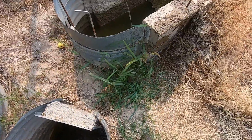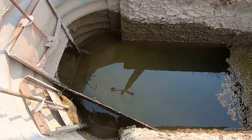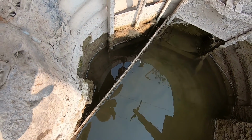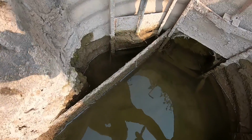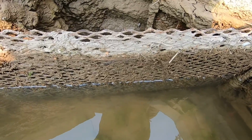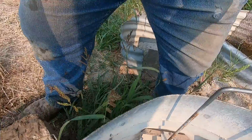It's kind of a puny little flow of water, and I can see why. The actual flow has been cut way down, coming down for some reason, I don't know why. I've opened up my gate here a little bit more, and got a little bit more flow coming, and I cleaned out that screen. I haven't cleaned that screen out for probably 2 weeks, 3 maybe at most, and yeah, it's been a real pleasure this year not to have that constantly plugging up that gate. So I've had real good water flow all year.